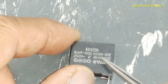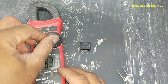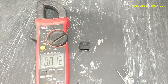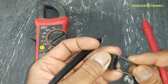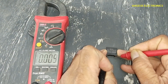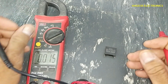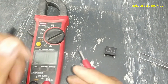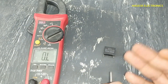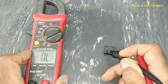When I searched its datasheet, there is no data available. We can only find this component on AliExpress. If we check it in capacitor mode — because there is a capacitor value mentioned on the body — it is giving 187 nanofarad. And if I check its resistance, it's giving open circuit. Let's disassemble it and see what's inside — why it is mentioning 120 ohms and 0.1 microfarad.